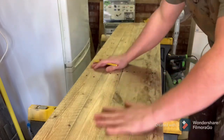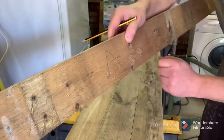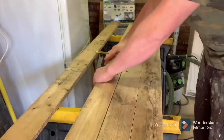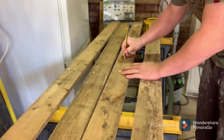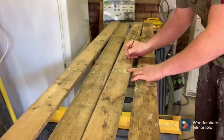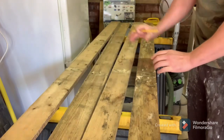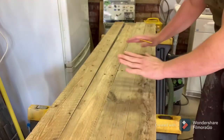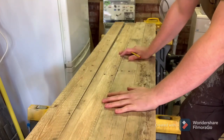That's them together. So they're all sanded, and then what I'm going to do is just label these A, because I've just started. So these on the back, we're going to label them on the back, obviously. So I'll label all these A, and I know all these pieces are the same then. So when I come to fit them on the wall, I know they're all going to be the same width and meet up quite nicely. So I'm going to get some more wood on here and show you the difference with the colours of the woods and the grains and what have you.